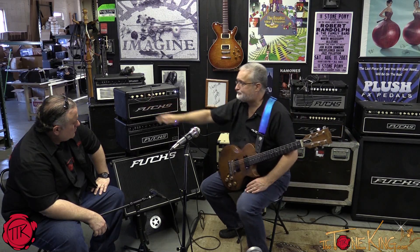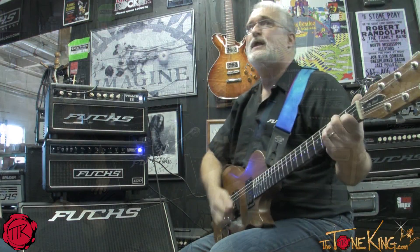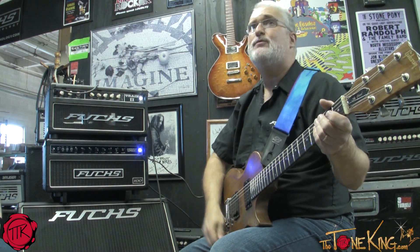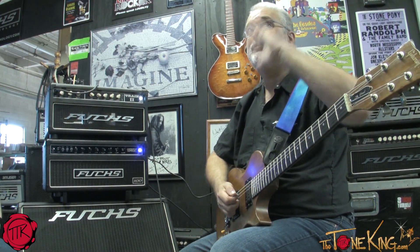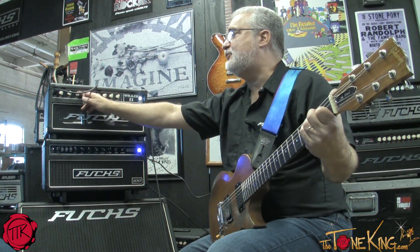This amp is my spin on the single-channel rock-and-roll JCM 800 — a gnarly amp. What makes it unique is it has a master volume and two controls which are actually gain controls, not volume controls. The difference is when a gain control is turned down it reduces gain but does not remove the signal completely — it actually controls the gain. So we can run this with the master up and the gains at their lowest position and have a pretty nice clean amp.